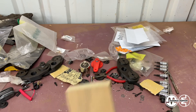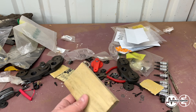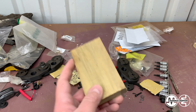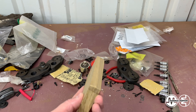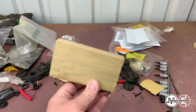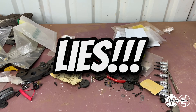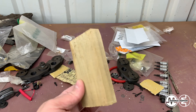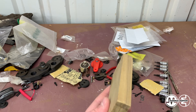So let's say just for fun I want to measure this block of wood. This is technically a one-by-three piece of wood. The dimensions will vary. One thing you'll learn is few things are actually the sizes they say they are — kind of like a two-by-four is three and a half by one and a half. This is a three-by-one, technically three quarters of an inch thick. Even the three quarters of an inch is going to be a lie. When you're going to the third decimal place, everything's going to vary. It's not going to be dead on — very few things unless precision machined will be 0.750.